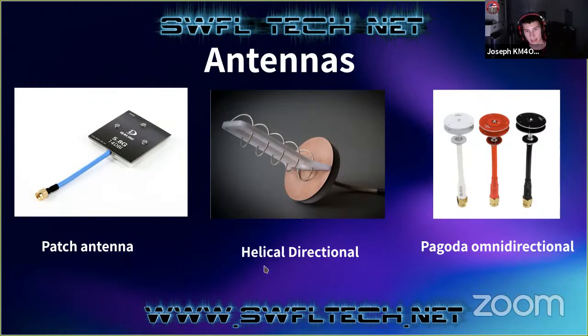We also have the helical directional, which is an interesting one. It's a coil, kind of like a spring almost, that goes up, and it has to be held in place by something, because if that moves, if it gets out of tune, then it's not even going to be directional anymore. These are very, very sensitive antennas to a lot of things. So they're not able to be abused at all. You've got to be very careful.